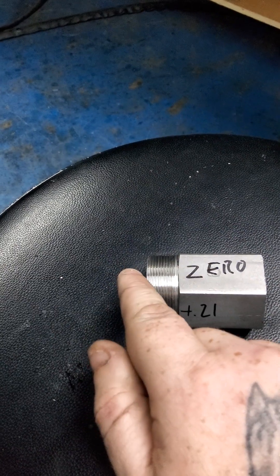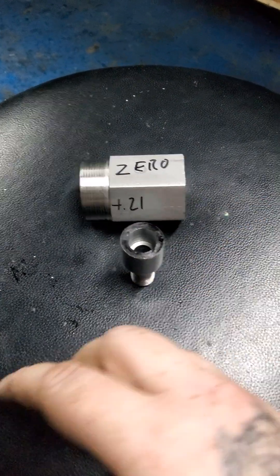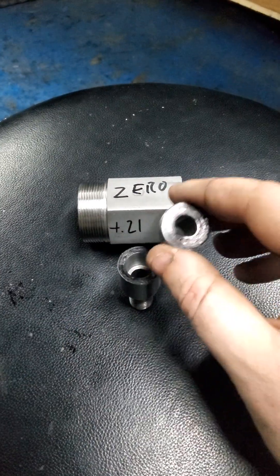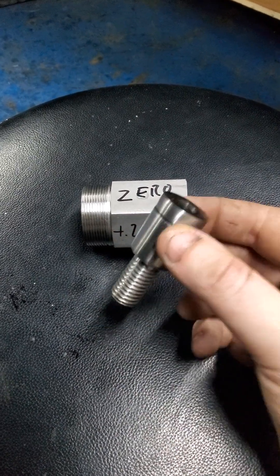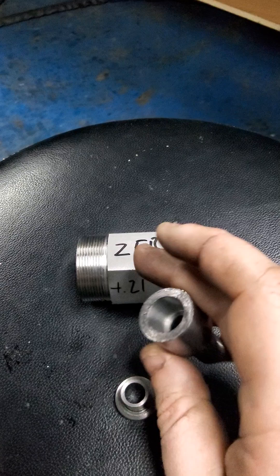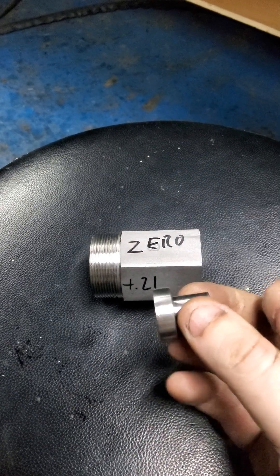Now I've got to drill some 1.6mm holes into this wall and also into this washer, because they've got to clamp down and close over each other like so. My guess is there is absolutely no way I'm going to be able to get reliable hole positioning clamping these parts into the collet with it the way it is.